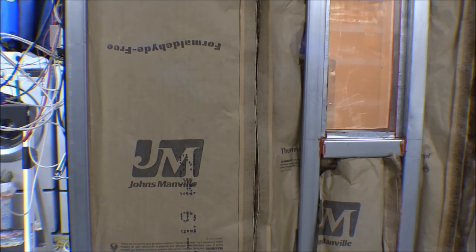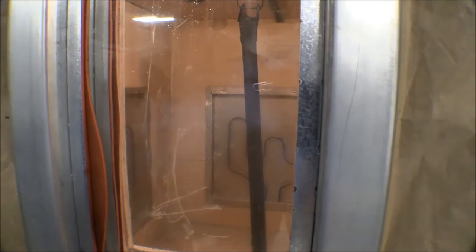I just stuck my first piece in the oven - a torque tube for a Piper Super Cub, the control torque tube that controls the elevators and ailerons. It's all powder coated black. I had a heck of a time with it - it was rust and crud embedded inside the tube, so I had to clean that all out with a wire brush. It took several tries.